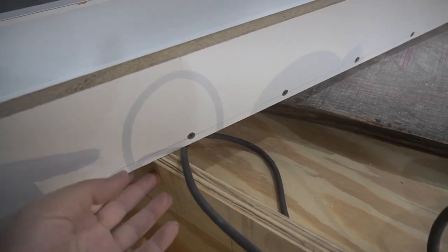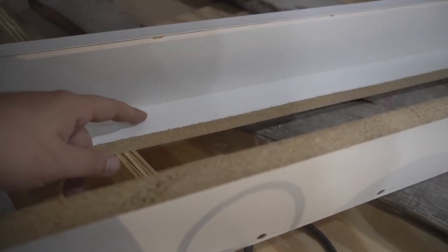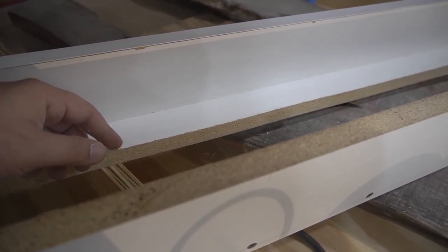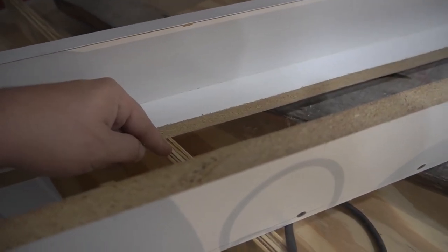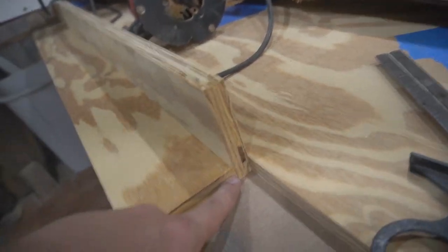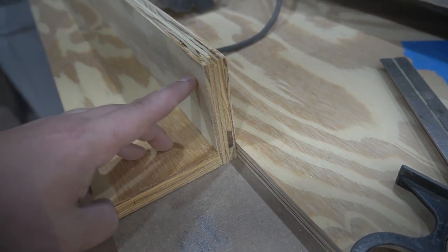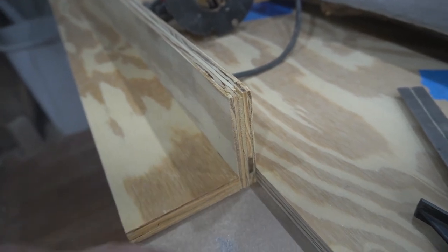So I figured out a couple of things. I'm probably going to drop this height down by a half an inch, unless we can't clear it. Either that or switch this three-quarter to half inch. But I'd rather lower down this short side to this beam, meaning this would be the tall side because it has the extra three-quarter. So I'll take off maybe a half off the table saw, just run this side along the fence. But it's dark, so I'll catch you tomorrow.